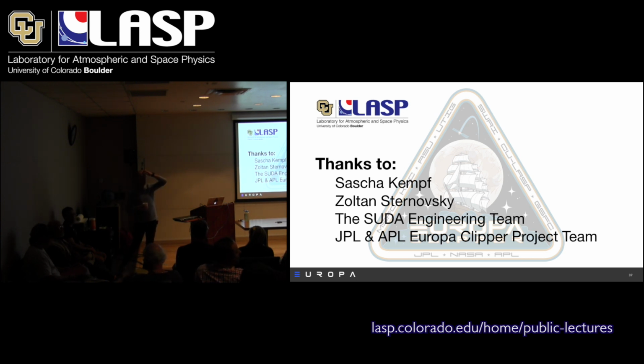Yes, so the system you have of the various voltage levels to redirect particles, what is it that physically exists there that is given that name? So, good question. The target is a big piece of metal, so that's easy. We hook a wire up to it. Then there's grids. We have these very porous grids, and these grids are actually photo etched. They're very thin, and we use a photo etching technique to carve out almost all the material, and what's left is only 10% of the material. So they're 90% transparent. They're conductive grids.